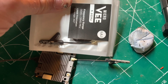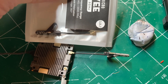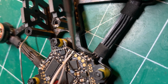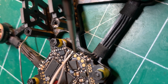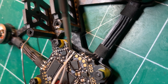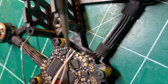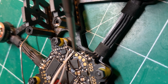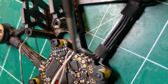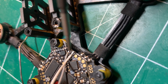I'm using these micro V VTX antennas. They're very lightweight, but perform really well, and they're not that expensive. The white wire goes to RX1, and the gray wire goes to TX1 on the flight controller. These are the two UART ones you're going to be using — white wire on UART1 RX, and the gray wire on UART1 TX.